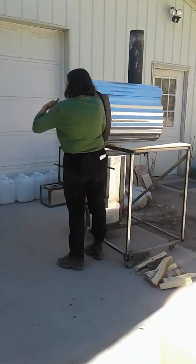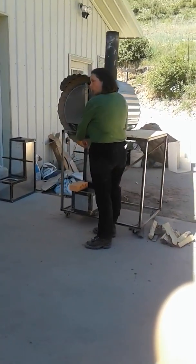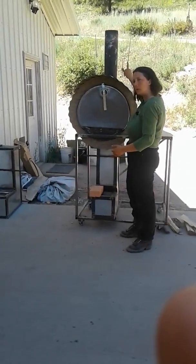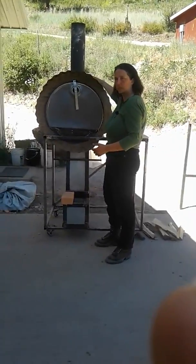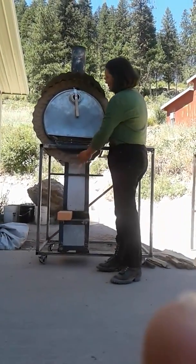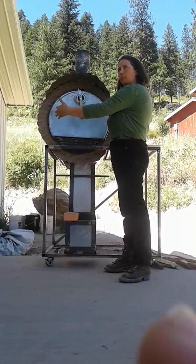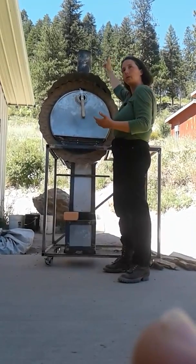This chimney actually goes all the way down to the base of the cavity behind the oven, and it's cut on a diagonal. So the exhaust gases have to cool down enough to get all the way down to the bottom before they can escape up the chimney. You're collecting the hottest exhaust gases up at the top — it stratifies, balancing the intensity of heat hitting the floor of the oven. It gives a lot of heat from the top, so you get more even heating and collect more heat before sending it out the chimney.